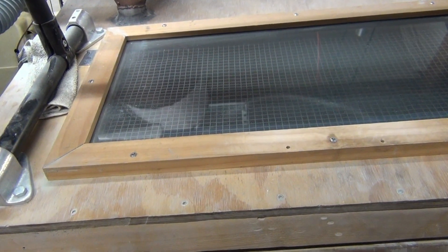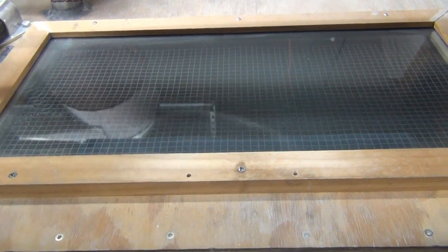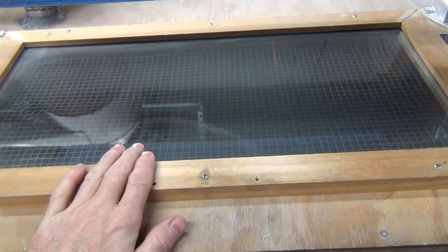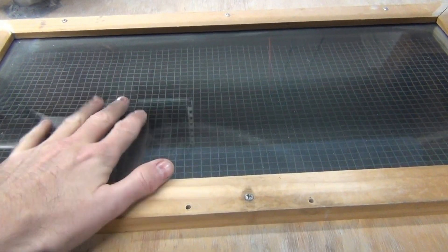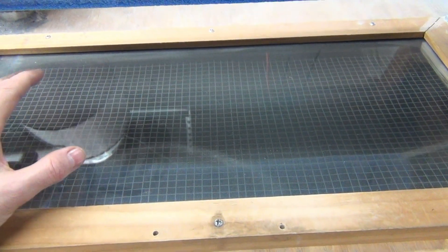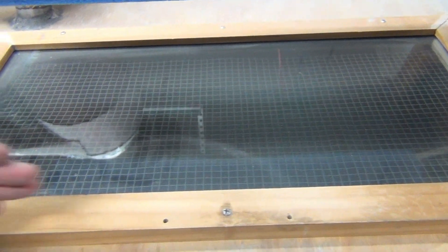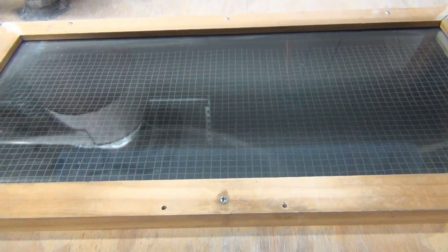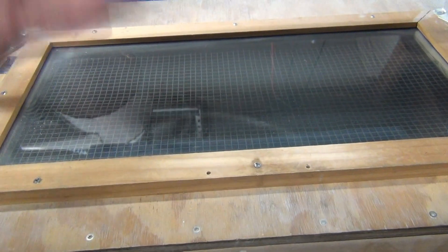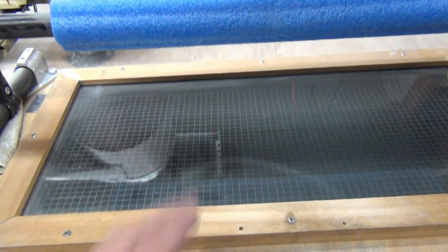The one thing I would recommend, if I was building or getting another cabinet, is I would have one with an upright glass — a vertical or almost vertical glass, maybe 10 degrees. It doesn't need to be tilted 45 degrees like this. In my opinion, a viewing glass at this angle allows more direct blasting impact on the glass when you're sandblasting parts — it puts the glass closer to the stream, so it frosts or gets etched faster. A near-vertical viewing glass would be a much better idea. But until I get one of those, I'm going to use this here.